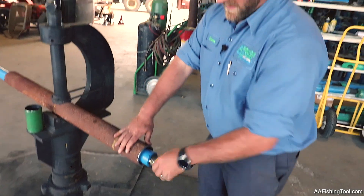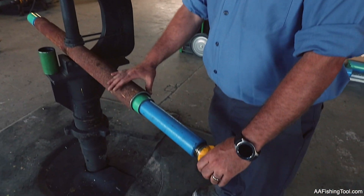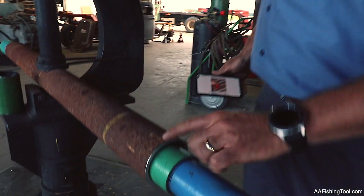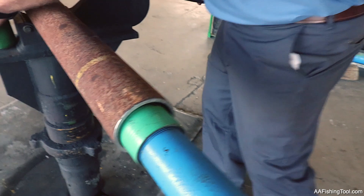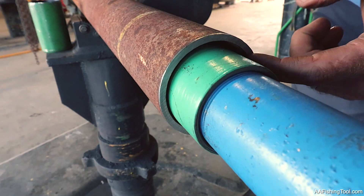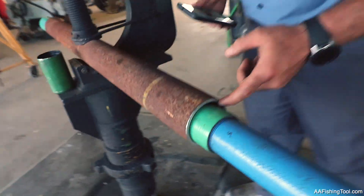The next thing to mention is your mud pump choice when you do a job like this. It takes more pressure to push this out of the hole, and if you're not using two and a sixteenth tubing and two and three-eighths, you need a bigger mud pump. When drilling with two and three-eighths slim hole couplings, you're very limited on clearance, and you've got to get a barrel and a half to two barrels a minute so you can actually drill and get your cuttings out of the hole.